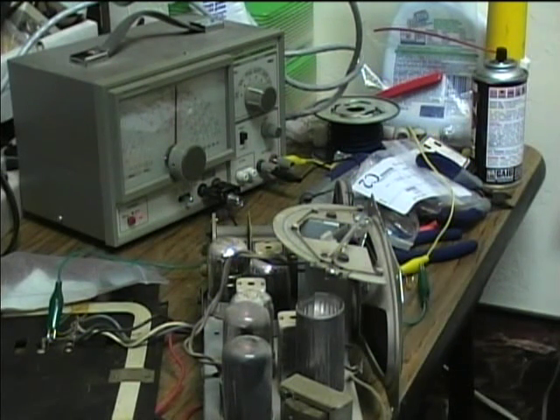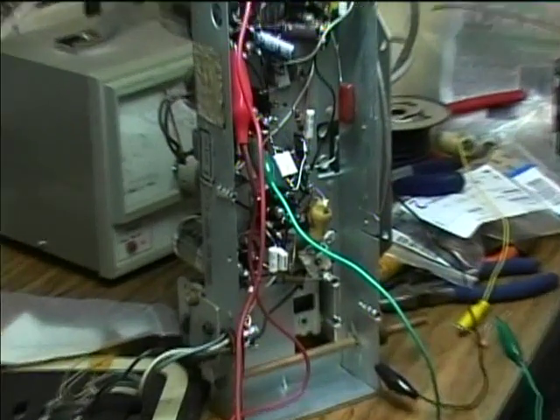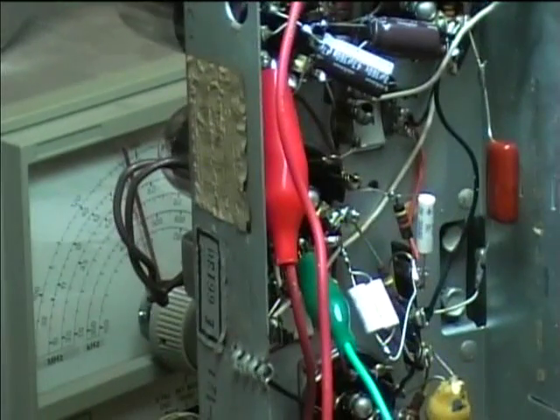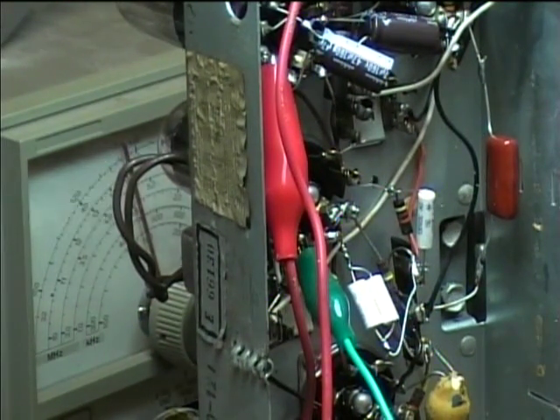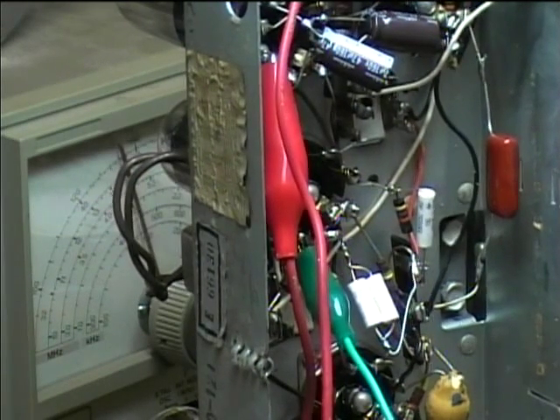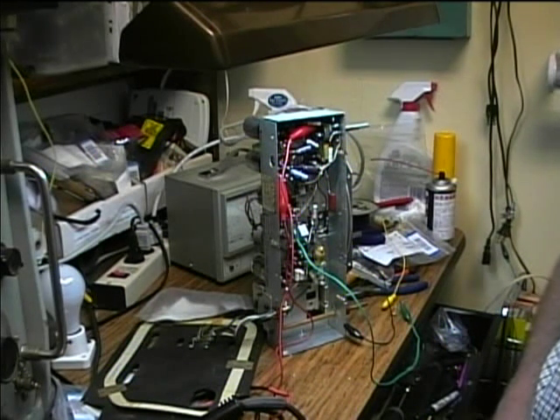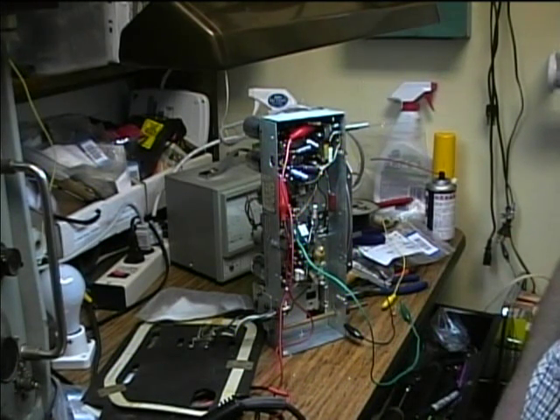What we're going to have to do is take those cans apart, remove the old bad mica wafers in them, and I've got a 100 pF mica cap so it can mount outside the cans. I've broken the connection between the first IF transformer and the IF amplifier to feed in a signal directly from the generator. We're getting the signal through, but there's still noise, and the amount of noise varies intermittently. So we'll have to remove the IF cans, label the terminals, and get those old bad capacitors out of them.